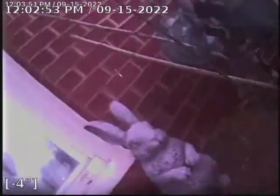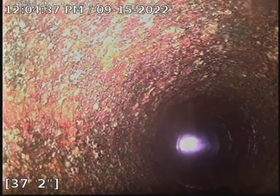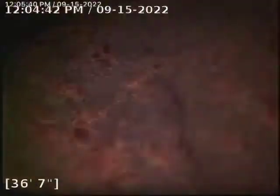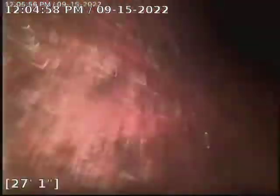We're going to pause this here. Alright, we're here at the 90. You can see that's a roof vent stack there, here at 38 feet. We'll go ahead and start backing up. This is a cast iron line. This cast iron looks like it's in pretty good shape. I ran my machine, got it all smoothed out, ran water, and flushed it all out. I didn't see any channeling in the cast iron either. No holding water at all.